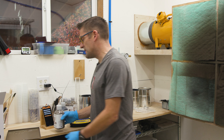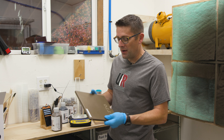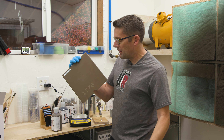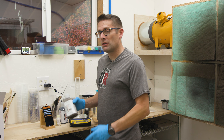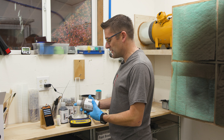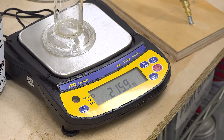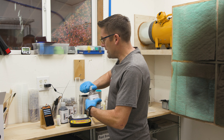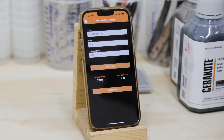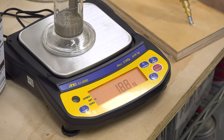For Cerakote I'm going to do two colors. I'm putting together a test panel like this one for looking at the color and for some laser engraving settings exploration. I've sandblasted a tray just like this — it's a stainless steel tray — and I'm going to put one color on one side and one on the other. This is H139 steel gray. As you can see, the graduated cylinder alone weighs about 215 grams, so I'm going to zero that out. I'll pour in a little here until I feel like I have enough for this test.